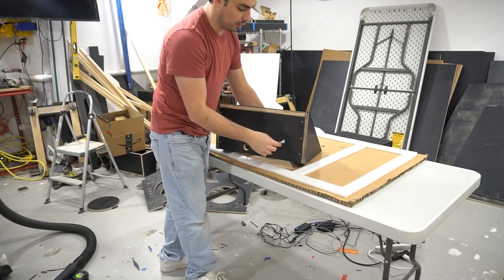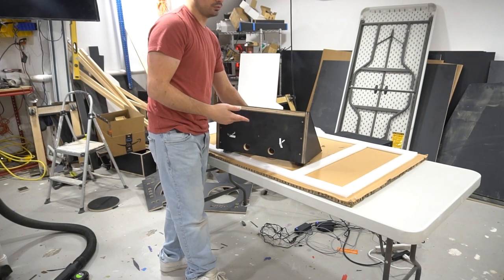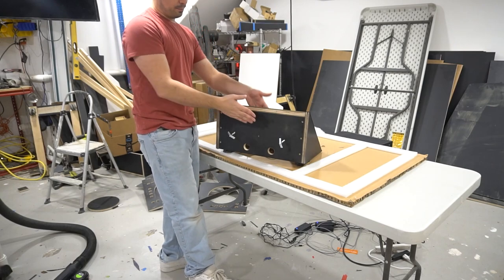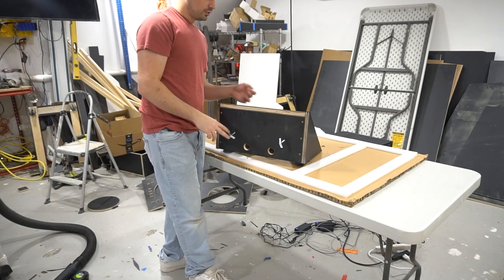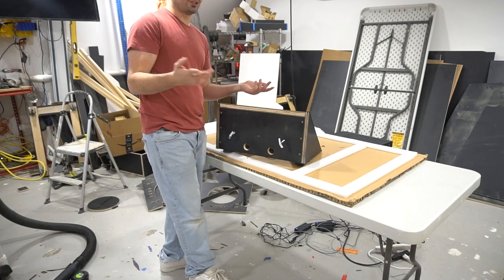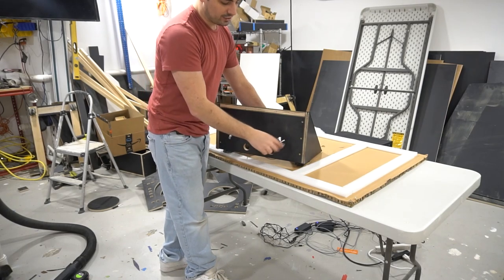I don't know his walls. You know, I've seen people have half-inch walls. I've seen people have 1-inch. I don't know, I'm not a contractor. So the big thing is, though, keep in mind, the piece of wood itself is 3/4 inch. So you might be saying, oh, you could probably do like an inch. No, you can't. Or you could maybe do 2 inches. I don't know what's behind his wall. So again, I'm gonna give him 3 3-inch toggles.